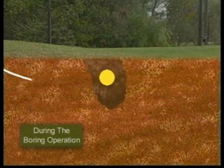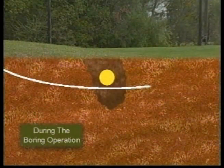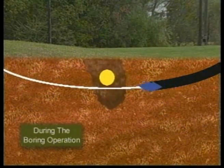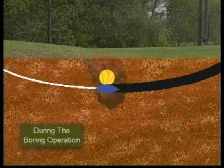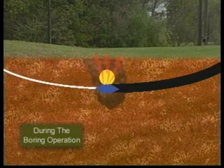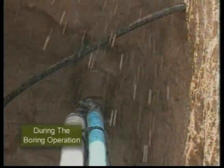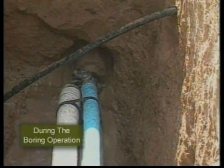Be sure to allow adequate clearance to account for the size of the back reamer and the flex of the drill pipe. Utilities should remain exposed on the back ream to verify changes in the position, either vertically or horizontally, of the reamer. Also, stand clear of exit points and the rotating drill components, once again to avoid being entangled or sprayed by drilling fluids.